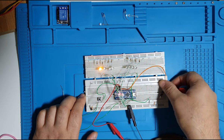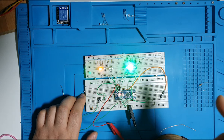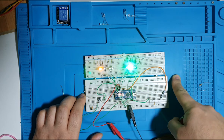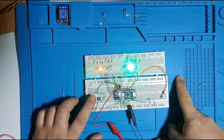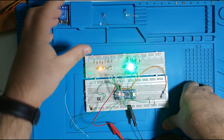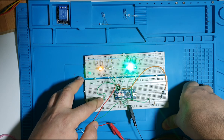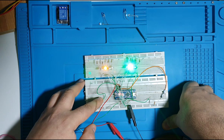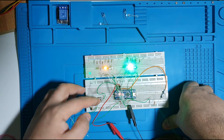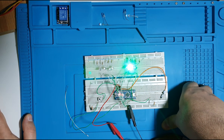For example, you can have 3V on one output and 5V on the other. To turn the power supply on and off, we need a separate button. If your application runs on 3V and you accidentally change it to 12V without disconnecting first, the application will burn out. So the safety feature is: first disconnect the power from the application using the hold button, then change the voltage, then reconnect.